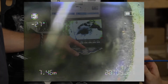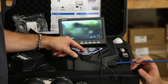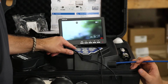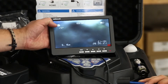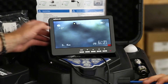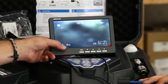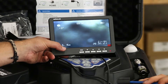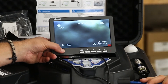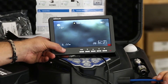Now we're looking at the top side of the pipe. Sometimes you can find things such as black mold, which in a place like Memphis where it's very humid you will find often. A great function here is it tells you which angle the camera is currently facing on the top left corner of the screen, as well as the distance traveled of the cabling, which at this point is 6.16 meters. You can also change the function view from meters to feet, which gives you more of a North American look versus the metric system.